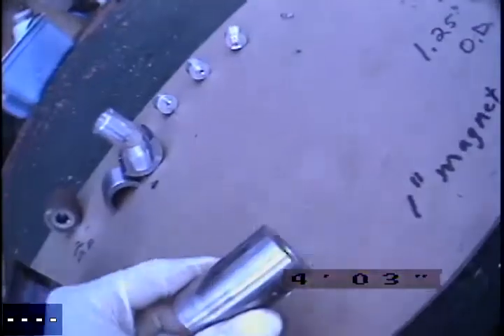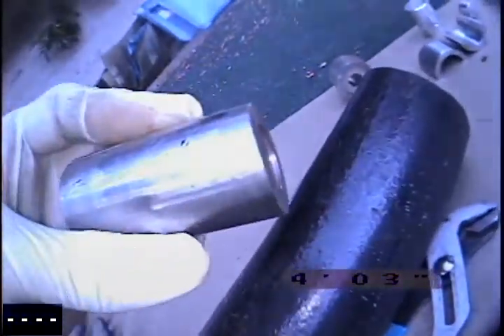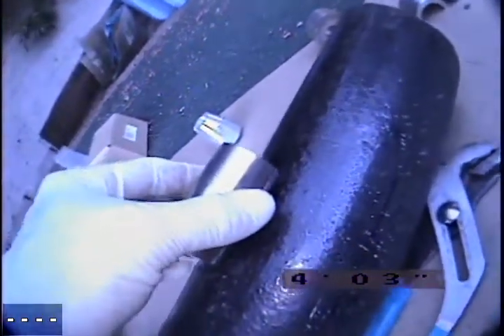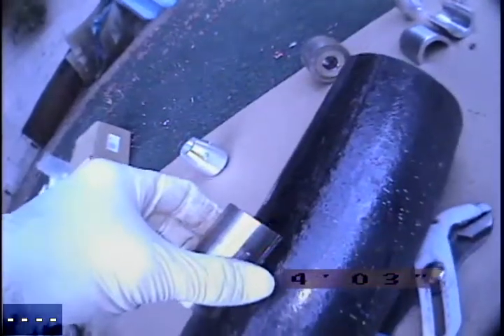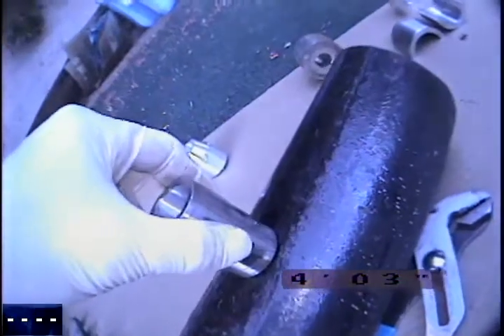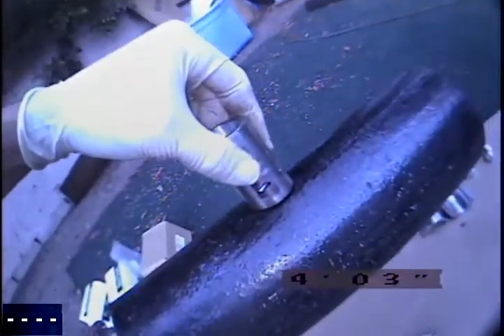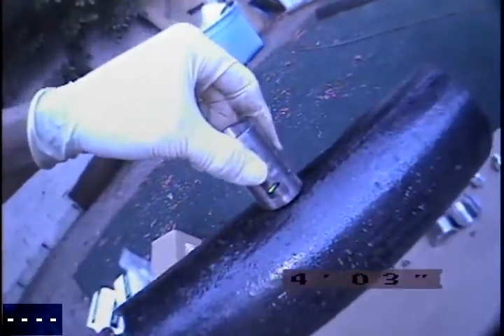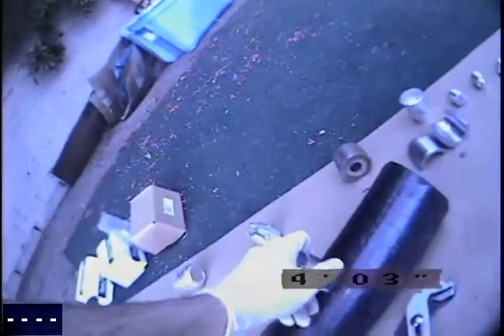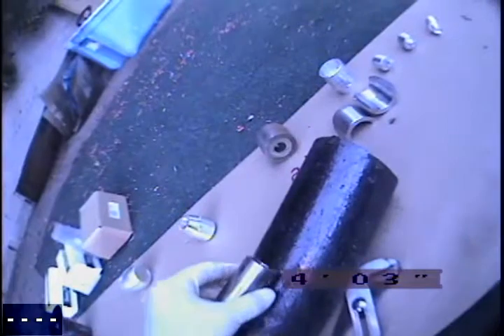To show you how this works: the steel shell is protecting it — there's no magnetic attraction to this from the side. This is a 12-inch long piece of 4-inch cast iron. The magnet can ride down the pipe, but when it comes to something magnetic, you can see it's lifting and holding this entire piece. I'm bouncing it and it does not come off. That's how strong these magnets are, but with the steel shell, there's no attraction from the side as it travels down the wall.